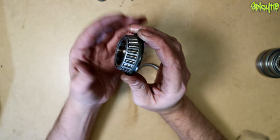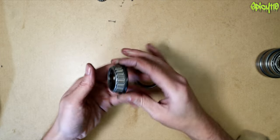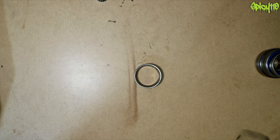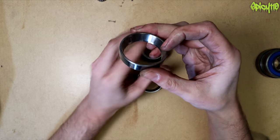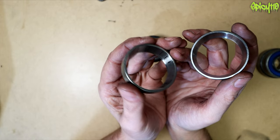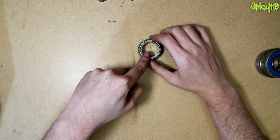Someone asked me to clean the completely knackered bearings and see what they were like. Under a microscope the surfaces are quite scratched, but they still feel smooth and spin freely — though very rattly. The bottom one was the worst. With grease in them the rattle is dampened, but there's too much free play, and the outer races have indentations and grooves from the rollers. What seems to kill steering bearings is: use the bike a lot, let them get a bit old, then leave it unused — they go out of alignment and get that notchy, stiff detent feeling.